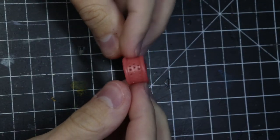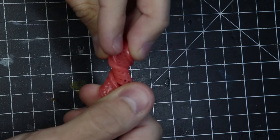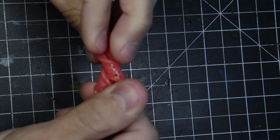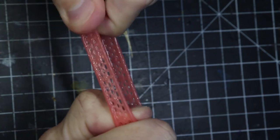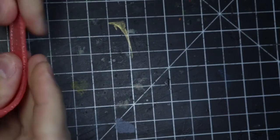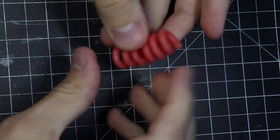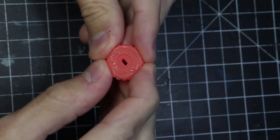Now let's try the F80 — this one is really flexible and really easy to move around. That's what they call the elastic resin. I have the same ring as before, and as you can see I barely push on it and everything flexes all the way, and the shape comes back really quickly. It's really malleable and flexible. The downside is the strength is less than the rubber one — if you push a little it'll break, but that's the trade-off between strength and flexibility. On the spring, everything came back really quick too.